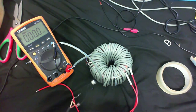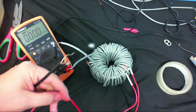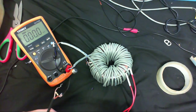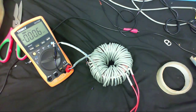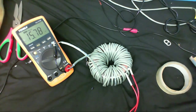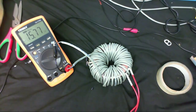Alright, let's plug this in now. So I plug the transformer in and see what voltage we get now. Of course, again, the meter is not on AC volts. Okay, we've got about 15 volts now, which is a bit higher than what I want. I want a little bit of headroom because I know that filament's going to pull the voltage down a little bit. So I'm going to get this to about maybe 14 volts and then try it.